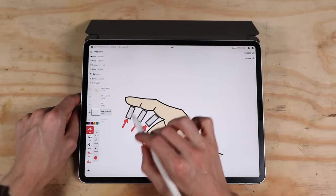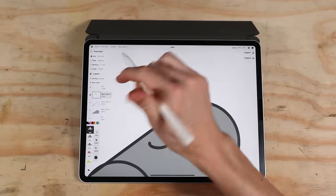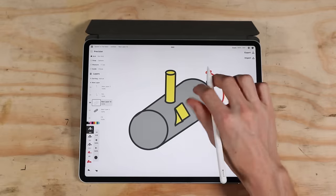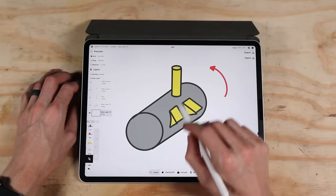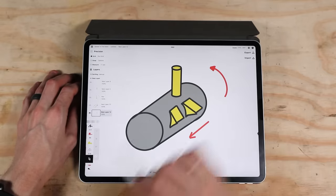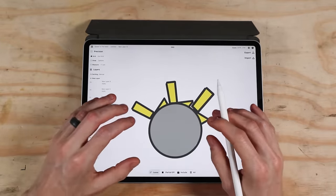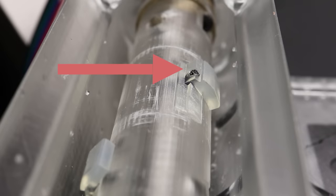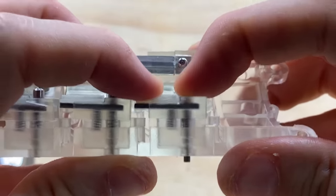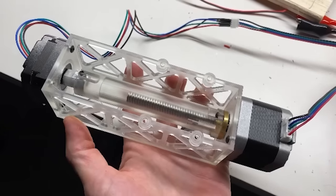What I wanted to do is make something with a little metal pin that I could push into every joint of every finger. The way I did this: imagine one of the pins pressed against a cylinder that I can rotate. If I attach a little wedge to this cylinder, when it goes underneath the pin, it's going to force it up. If I make an even bigger wedge and move the cylinder over, I can spin the cylinder and push the pin up even higher. All I have to do is rotate the cylinder and shift it left and right to control how high the pin goes. Because it's a cylinder, I can pack lots of ramps and lots of pins into it very compactly. Here's what some well-used ramps look like IRL — that big bump next to them is used to trigger the pin locking and unlocking mechanism, keeping the pins in place when they're not under a ramp. I can control where the cylinder goes with two opposing motors: driving them together rotates it, and driving only one of them moves it left and right.